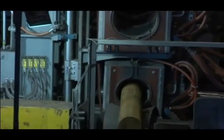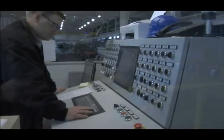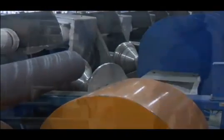Tubes can receive a number of finishing operations to change the steel's structure, grain size, tensile strength, and physical dimensions. Cold and hot working, turning, and thermal treatment processes are all available. Our 2 quench and temper facilities provide significant capacity to heat treat steel bars and tubing to meet stringent customer requirements for strength, toughness, hardness, and uniformity.